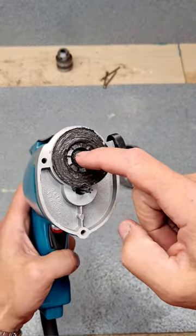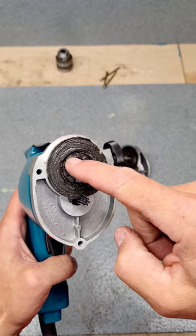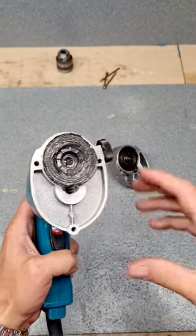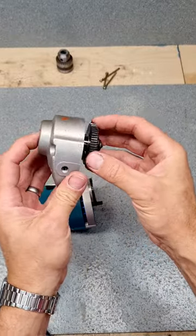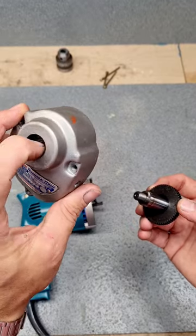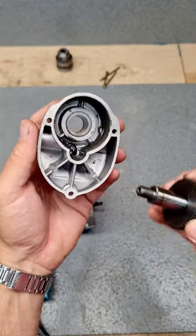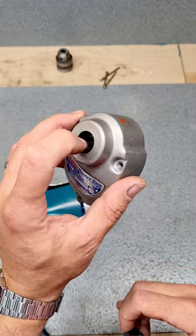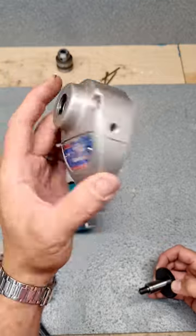All she's doing is driving over this, driving up these peaks and then dropping down. So the chuck is just going up and down - there's no actual hammer, it's just a rattle. There's your actual spindle - no bearing on it, steel bush on it, no bearing. So these things started getting stuff. We'll clean that out. A wee oil seal up the top there as well.